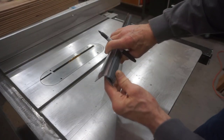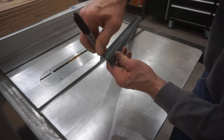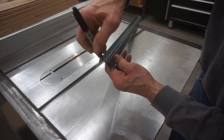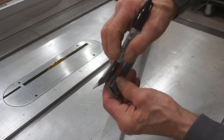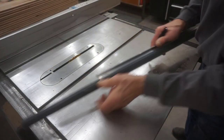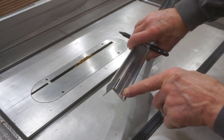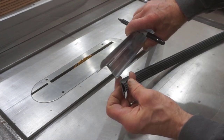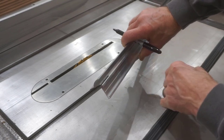This kind of modification is a little bit dicey but it's easy enough. The modification I want to make involves cutting off this front part of the door bottom by separating it right here. That way I'll have a nice extruded aluminum channel for the weather strip to fit in that can be attached securely to the bottom of the door with a few screws.